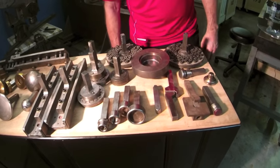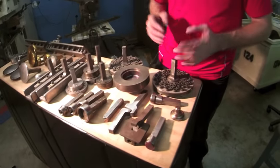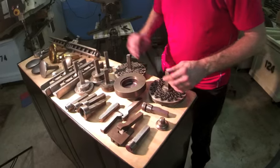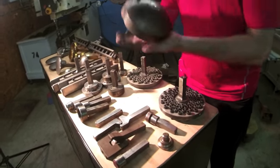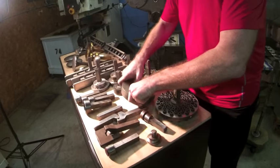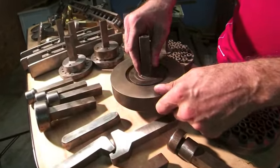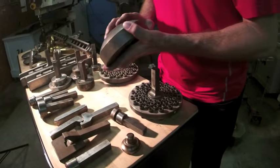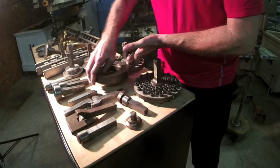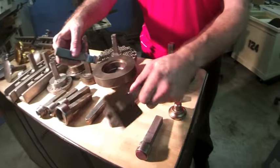Pullmax P201 and P9, a variety of tools are available with those machines at a small extra charge. Some heavy raising tools, which we invented. The main part of the tool is S7. The center is very hard, I believe M-series steel. This is, I think they call it a louver tool,